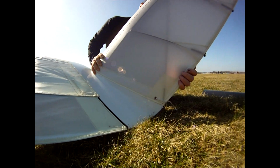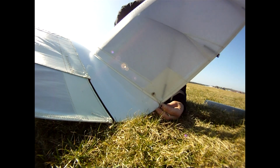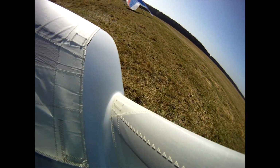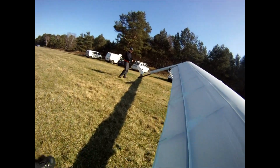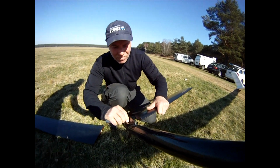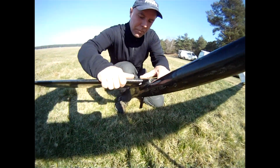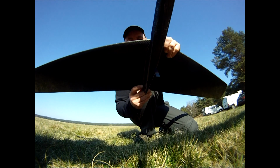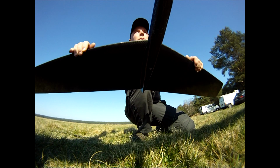The winglet has a turbulator on the inner side. This makes a better steering characteristic. Here you can see the turbulator. For better damping, I designed a tail wing. The whole glider was also tested without this wing by the DHV. It's load tested for 6G, but we tested and the result was more than 10 Gs.